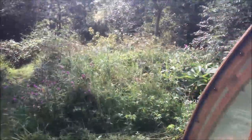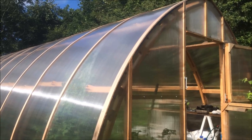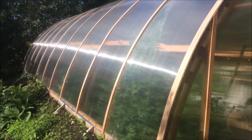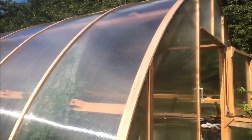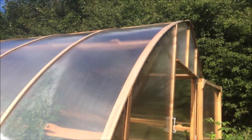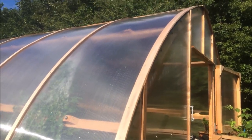I'll show you outside and how I've attached the sheets, because that's a bit different to what other builds do — I came up with my own system for that. I didn't really design this to be particularly pretty, it was really designed just to use local timber, but it's ended up looking really smart which I'm really pleased about. On the outside you've got the twin wall polycarbonate sheets that bend quite easily to this shape and go up to a ridge piece — the ridge is timber — and then I've put a cap on top of that to shed the water off, which works really well.